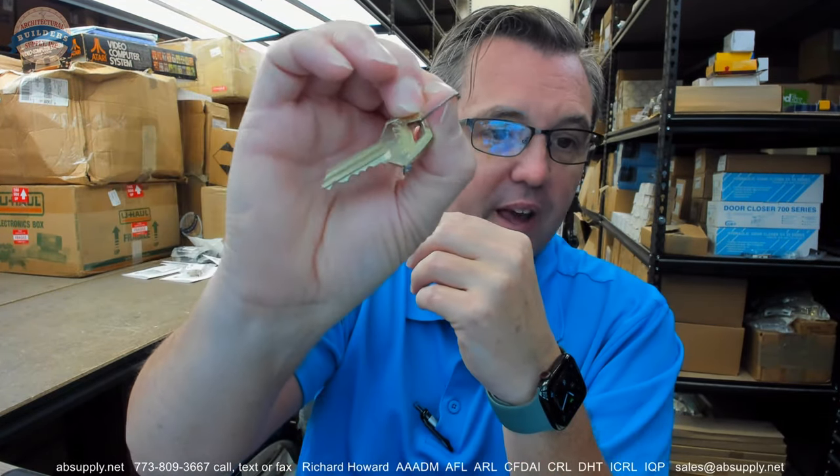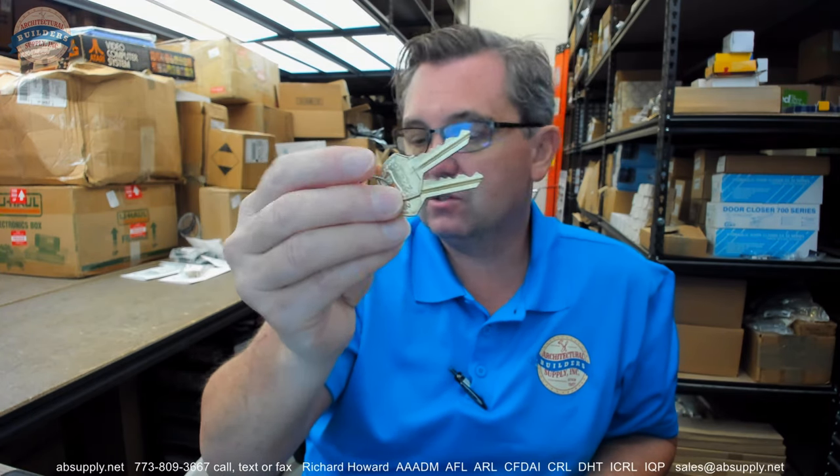You can also do this as a six pin — it would be a 15796, which means it's the same cylinder but combinated six, and then you'll get six pin length blanks. So be mindful if you're doing a project and you have existing keys: are they five or six pin? You want to be sure that you have a cylinder that's going to accommodate that. The cylinder itself will accommodate either a five or a six pin environment, but if you're doing a six pin system, you'd want to order keys that are cut accordingly. You can order them O-bitted as well — that can be done as a factory order.